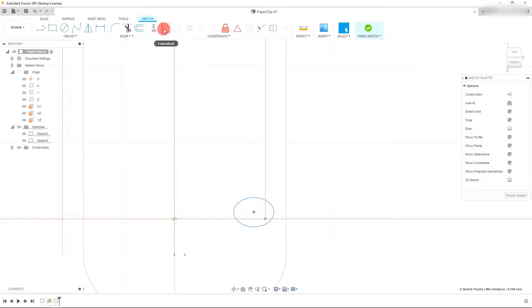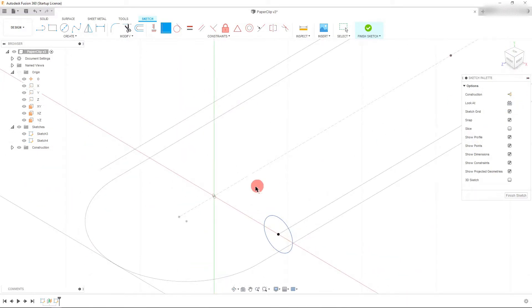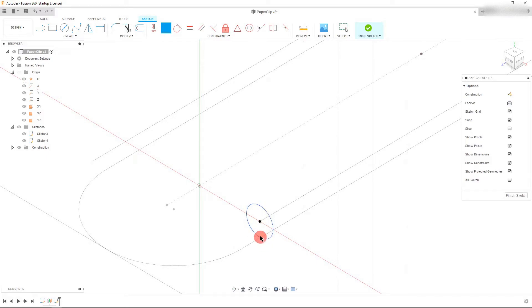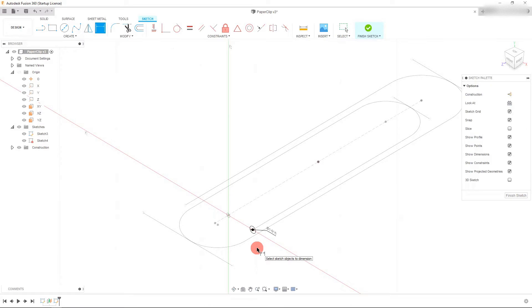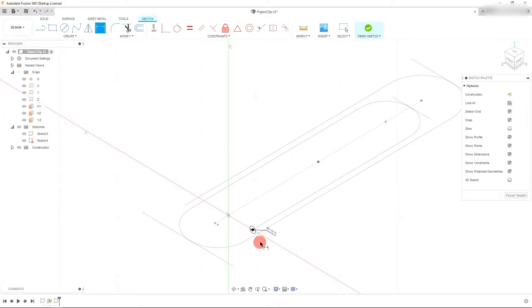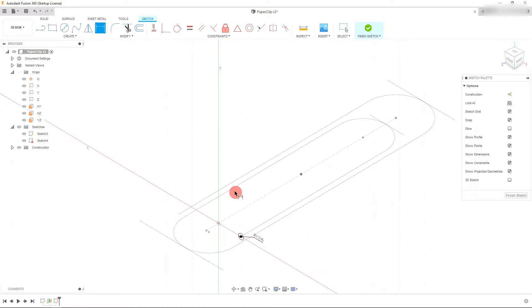The same way we did before, I can make these coincident. What I'm doing here is making two different planes coincident to each other — they're at right angles to each other. If I rotate, you can see they're actually perfectly 90 degrees from each other. Now we're going to set a dimension for this circle: come to 'Sketch Dimension' and set a dimension of 40 thousandths of an inch, or about 1 millimeter if you'd rather work in metric. I prefer to work in freedom units. From here we can now create our sweep.